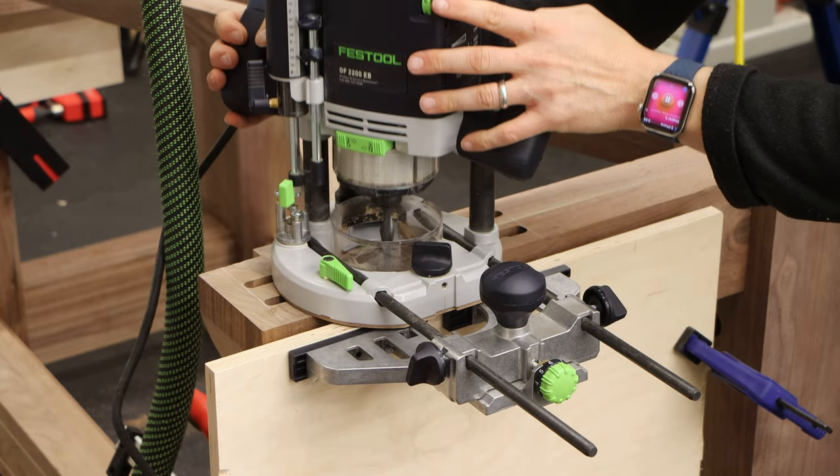And that's it. Sadly, I haven't had a chance to use the workbench much, so I'll probably post a follow-up video about its actual functionality. The most common question will be about racking — I toed in the long side of the vise, similar to the way a leg vise is toed in, which allows the vise to straighten as the jaws are compressed to grip smaller pieces. All I can say for now is, so far, so good. Half the benefit is being able to expand the bench top to 33 inches, and when I recover, I'll make an insert for the vise that allows a full-width solid top. Specs and stats will be included in the description.